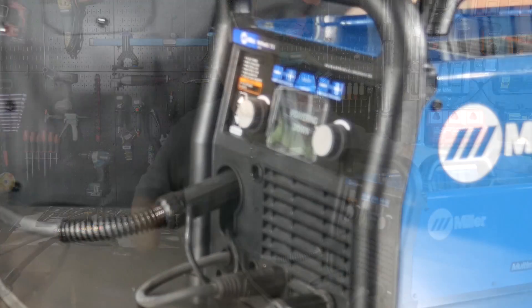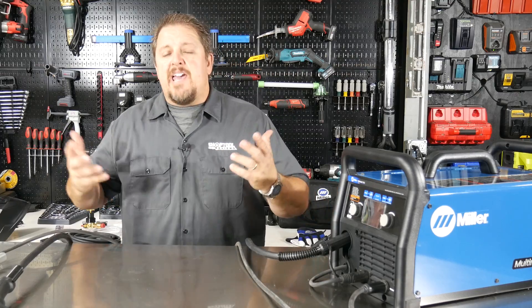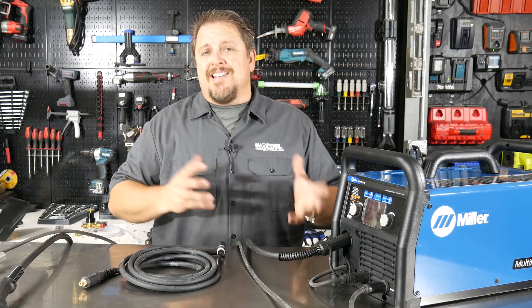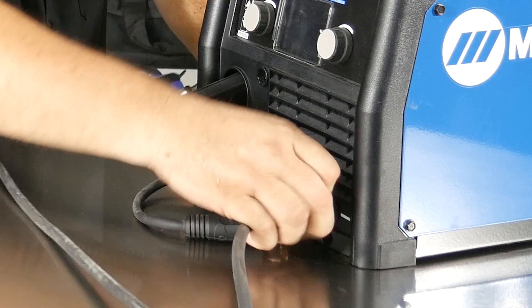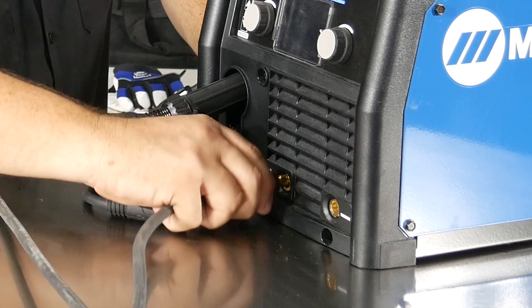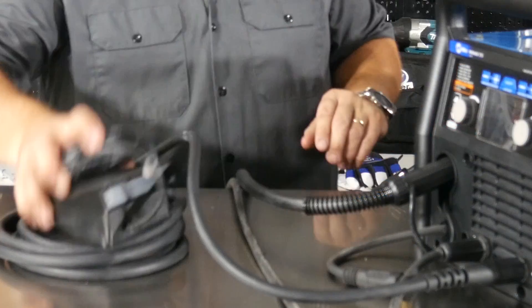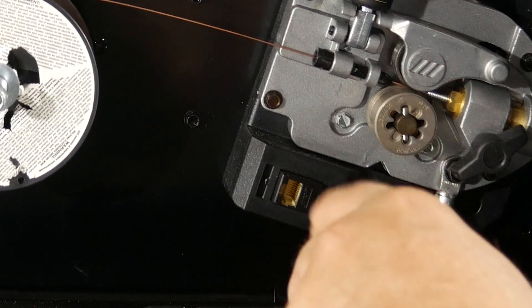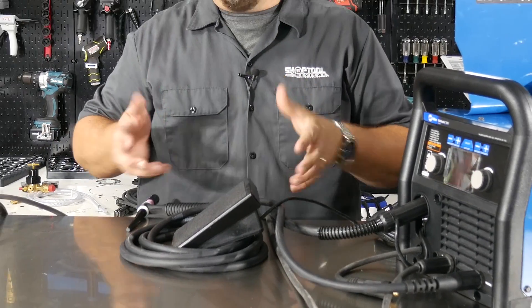If I wanted to change the process to TIG, it's very easy to do. I'm going to shut down the machine — you'll hear it power down and the display says 'Powering down.' I'm going to unplug it. Assuming we had our argon set up, on the TIG process we're going to be electrode negative rather than electrode positive. So I pull out my wire feed, move the work lead or ground over to positive, and then my TIG torch goes in where that work lead was. The foot pedal is as easy as running the wire through and plugging in the RJ45 connector — it looks just like a network cable on a computer. Plug that in and now my foot control is ready, and I can handle all the gas control from my foot to the TIG torch.